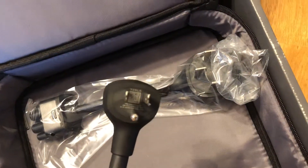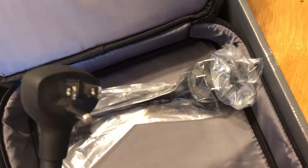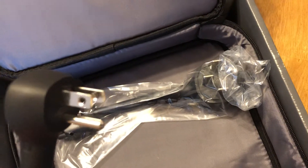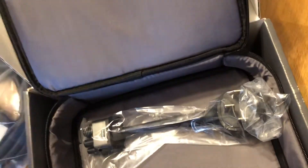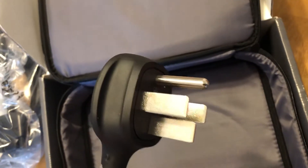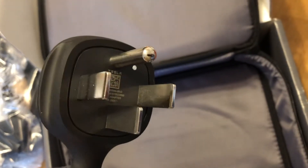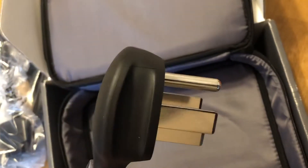First we have the normal 110 outlet adapter that you plug into any outlet. I also have some NEMA 14-50 outlets in my garage — 240 volt — so that should be quick enough to get the 32 amps out, since those outlets are 50 or 40 amps normally. That should be plenty fast to charge my car no matter how much I drive around town. And here is the NEMA 14-50 plug. A lot of people might know this as an electric oven plug in the States. Some electric dryers also have this type of plug, though it's mostly electric ranges, and of course now EVs.